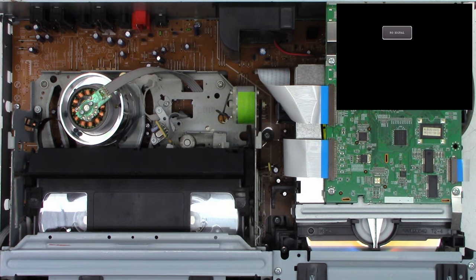47 at 1.8, I'm okay with that. 330 at 0.3, that one's perfectly fine. Another 330, 0.6, 0.5, that's okay. 0.4, another 330. Now, I have had to replace these. These are 47s at 6.3. 2.3 ohms and 2.6. This is the last 47 at 2.5. Not too terribly bad. I'm used to seeing these being defective at like 5 and 6 ohms, so I'm going to let those slide at 2.5 ohms.